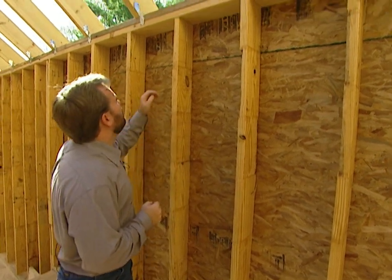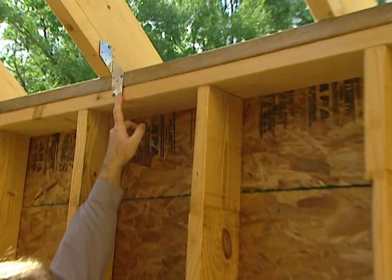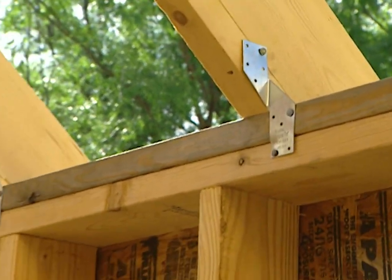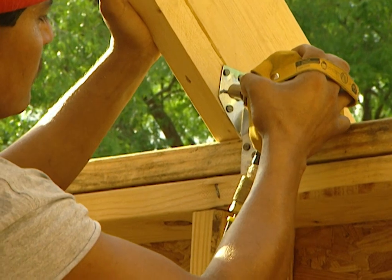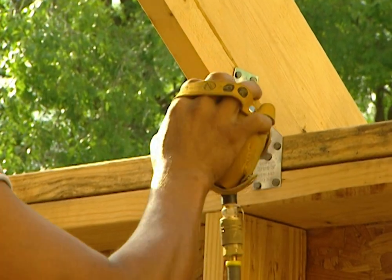When the roof comes off the house falls over. To prevent that we've added rafter clips — you can see one just started here and all the others added behind me. That little piece of steel attaches to the top plate of the wall and to the rafter. For wind to take our roof off now it has to be strong enough to actually shear these nails in half or rip the steel apart, so it can withstand about three times as much wind and still keep your roof on the house.